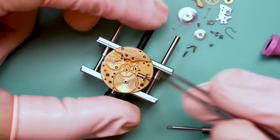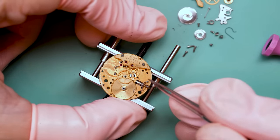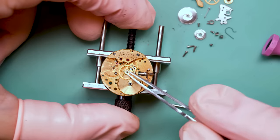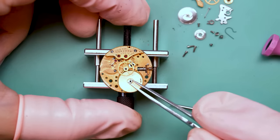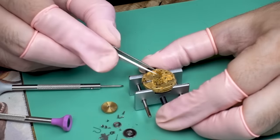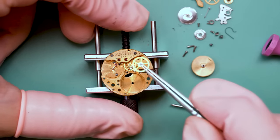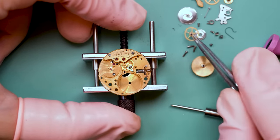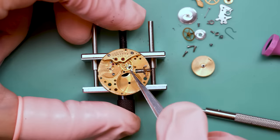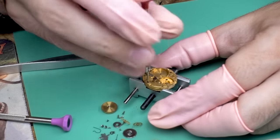The clutch wheel and the sliding clutch are rusted solid, and that stem is stuck in there too — so that is going to be an issue. That was why we couldn't take the stem out, and why we couldn't get it out of the case. And it's obvious where the water ingress happened — it happened at the crown. It looks like a lot of it got in, and the water seems to have accumulated on the dial side rather than the movement side, where these tiny wheels, when they get rusted up, they're just gone — they literally just disintegrate.